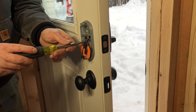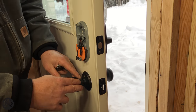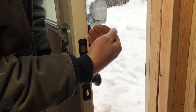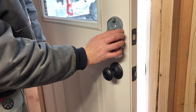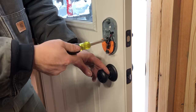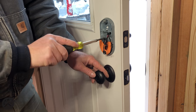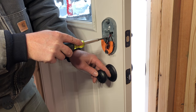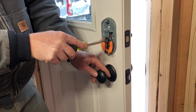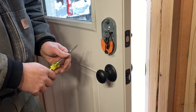I like just using a screwdriver so you know exactly how much tension you're applying. Before you tighten it too much, check the outside to make sure it's straight, because this can move a little bit. Then check the inside and make sure that's straight too — you can twist it a little bit. Once you know they're both straight, go ahead and tighten it down nice and snug. You don't want to over-tighten it, but go nice and snug, going back and forth between the screws until they get seated properly.